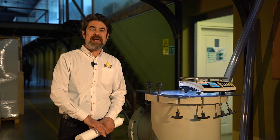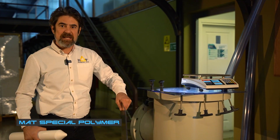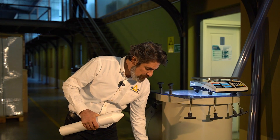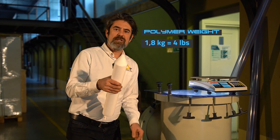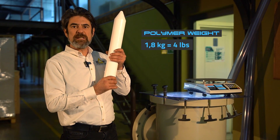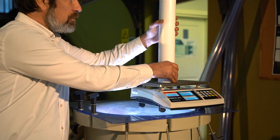And now we will make an impact test to prove the mechanical strength of our military grade transparent polymer and transparent PVC. We will use approximately 1.8 kilograms of weight which will be free falling from different elevations with a pointy edge to increase the impact.